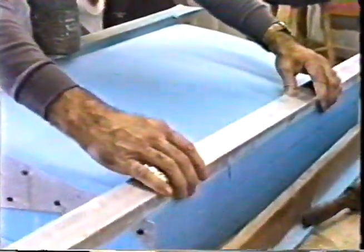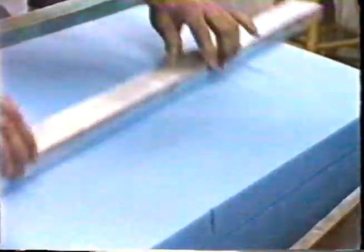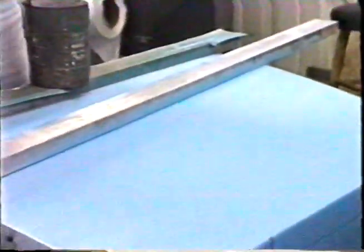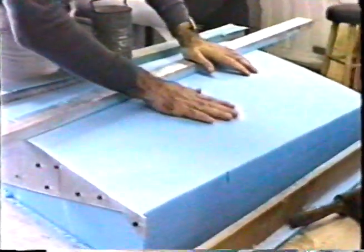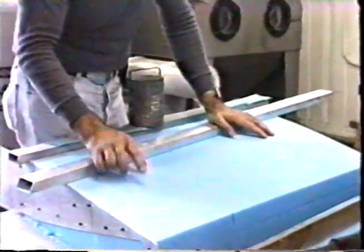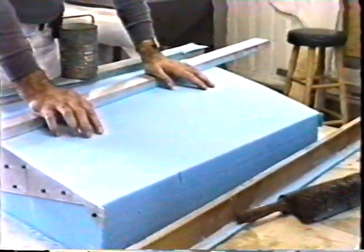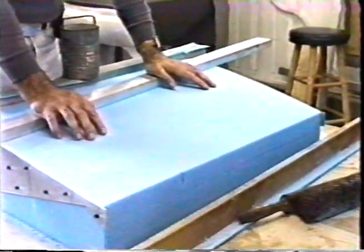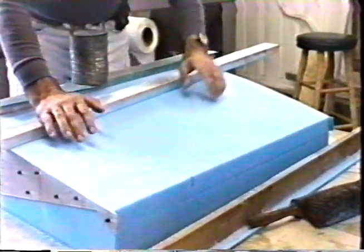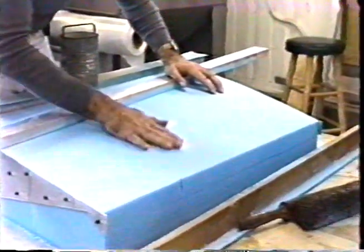And take a mental note of what these areas look like on your wing, so that after you've put your carbon fiber on these areas and you fill and sand, as you begin the sanding process, you notice that, ooh, I've got more fill in this area and fill in this area. But you'll recollect the reasons why. There are going to be some minor imperfections in the surface. There'll be less of a shock if you do this mental survey of your wing. This area did not get sanded. This area did not get sanded, and it's slightly below contour.